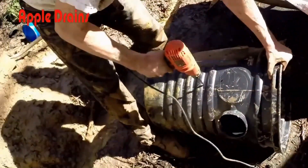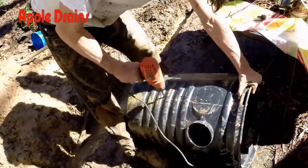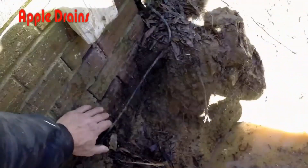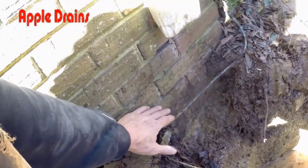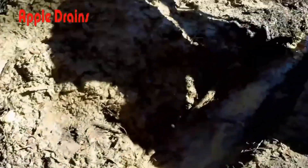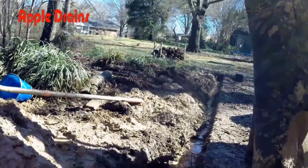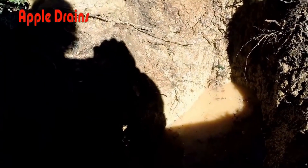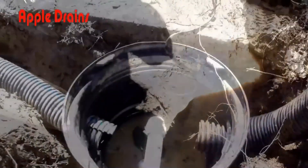Sometimes we perforate the pit, and we're putting this basin right beside the foundation of a home that has been flooding for many, many years. Water rises up so high here in the backyard, and the new owners have decided they're going to solve this problem. We're going to hook up that downspout and run the gravel perforated pipe from the catch basin over to the sump basin, and the sump pump will lift it up and send it out.